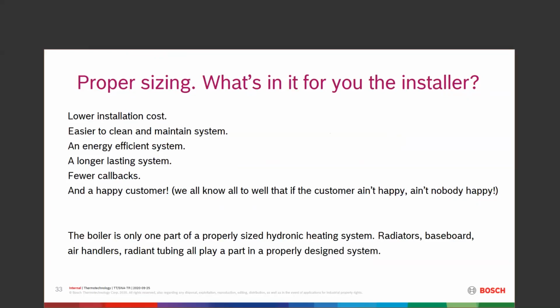And then through the end of the 90s and into 2000, the home had a big renovation. Somebody blew in R60 in the ceiling, R40 in the walls, all brand new windows, did air sealing, made that house super tight. That BTU load that might have been 130,000 in the beginning, that somebody added to 200 and then even went bigger, might now only be about 60,000 or 70,000 BTU.